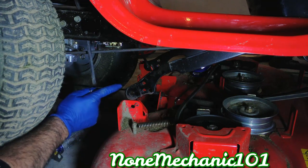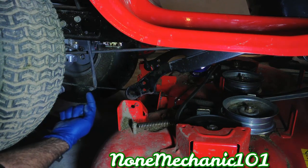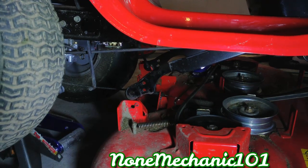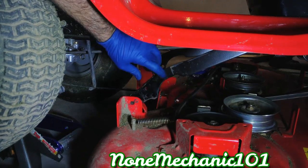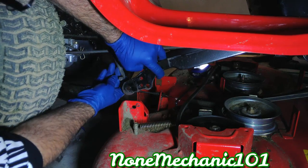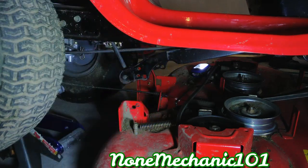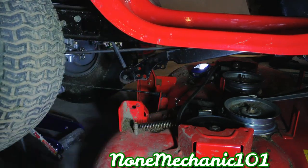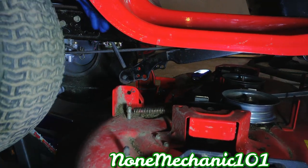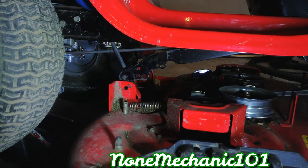We're gonna have to put this first right in here, then we have to put this on the metal bracket before we can put the cotter pin. So what I'm gonna do is I'm gonna push this in, I'm gonna put this right here, lift it up, put the rod right there but not all the way in — just to hold it there. Then I'm gonna go with my hand and lift up the deck from the bottom and pull it towards me a little bit, and I'm gonna use my hand from the back over here.